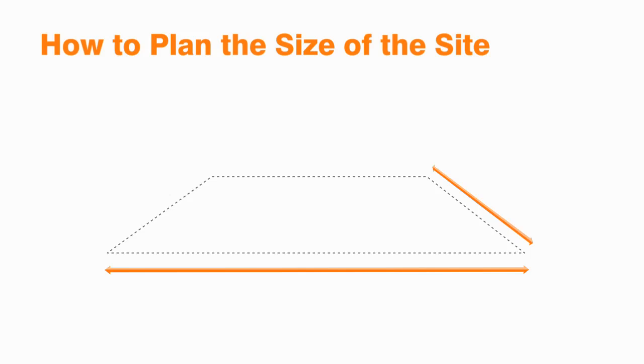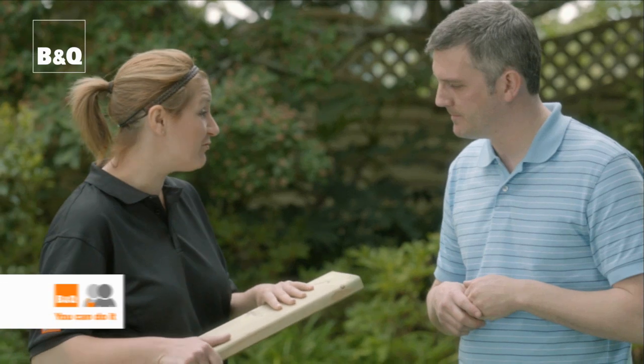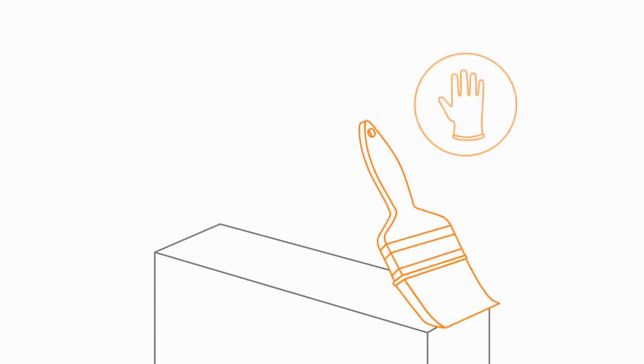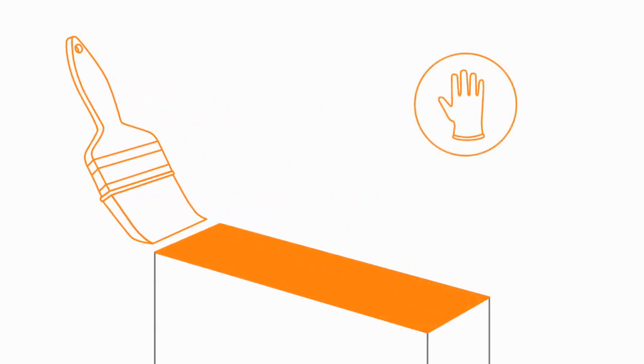You don't need to be a carpenter to build a deck, you just need some basic skills. Just remember to plan a little bit before you start, and do a few measurements as you go along. And of course, it does help to have an extra pair of hands too. We're laying this decking which has already been pressure treated against decay, but these cut ends we're going to seal with some end grain preserver. Always use gloves when handling end grain preserver.